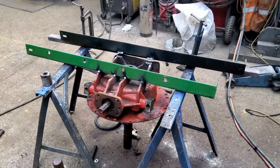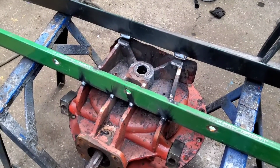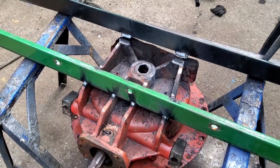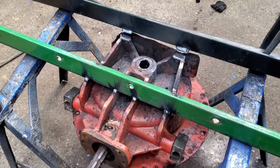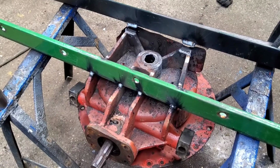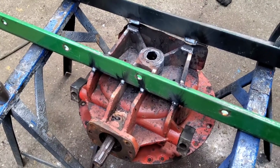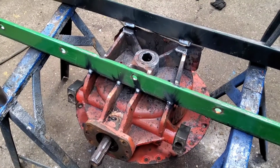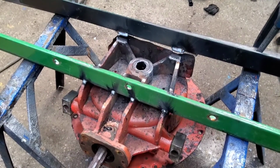and have another go. I've got it rigged up a little bit different to try and get a better hit at it. By the way, I used the 30-ton pullers on it originally, and it wasn't having none of it. So I'm going to weld that back on and try again, and if we're still having no luck, outside we've got a press, and the ram on it is about 10 inch in diameter, so that should push it out.